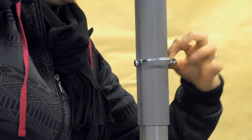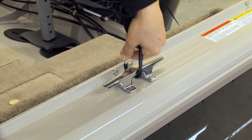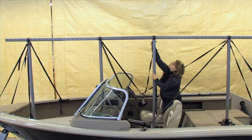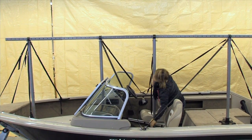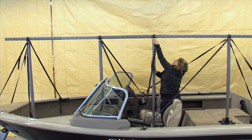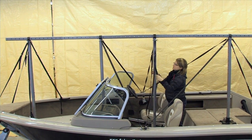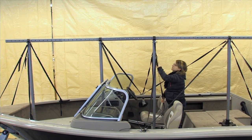You must now stabilize the new vertical posts using 2 straps per post. Be careful, these straps must be attached to the eyelets in part C at the top of the vertical posts only and be solidly attached to opposing anchor points on the boat and tightened until an adequate tension is reached.